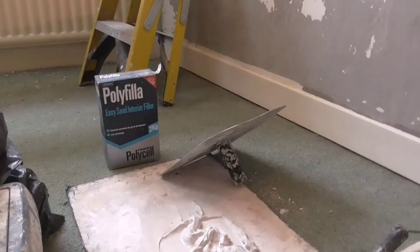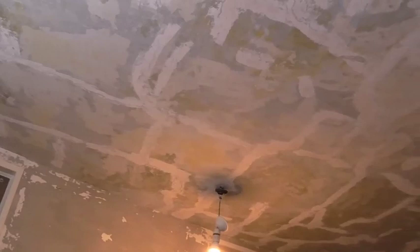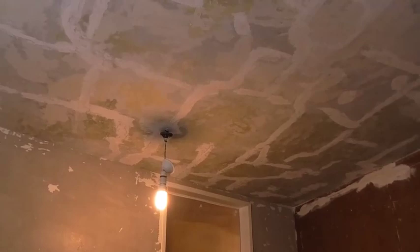That's what I'm using. A lot of the filling is done on the ceiling mainly, so that's ready for a sand down, another coat of PVA diluted, and then I'm going to line it and then get it papered and then finish the rest of the room on the filling down the bottom half. So then I can line that the next day tomorrow.